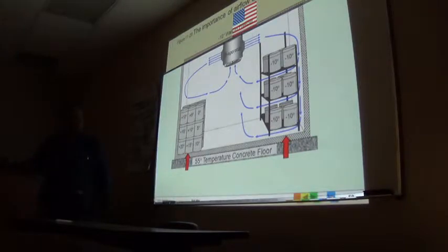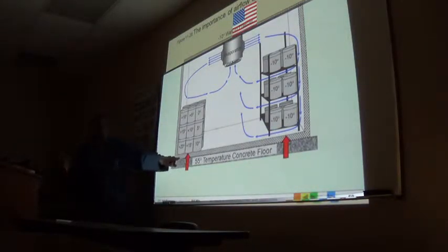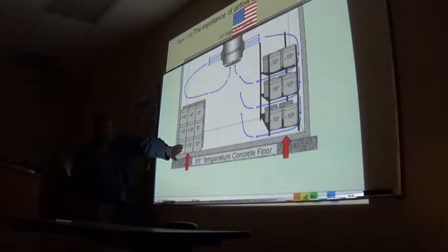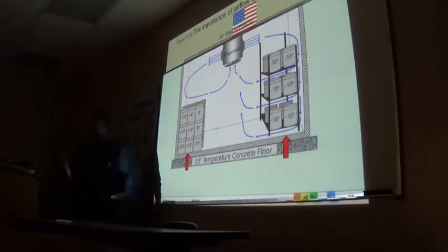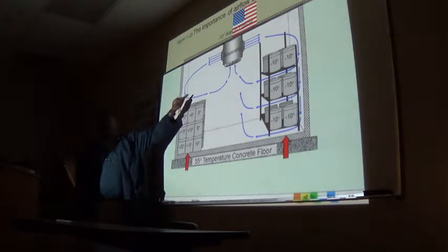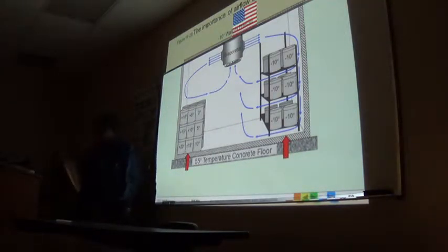These temperatures here, though, on the left side, the one on the bottom corner is 20 degrees. Yeah, because this is sitting on the floor. It's all the insulation. And it's touching the wall. There's something on top, there's something on the side, and there's something there. So this can't get any kind of air, period. So, by the way, this is a no-no in the food industry. Nothing should be on the floor. That's what I'm saying, the shelves are supposed to be used. Does that say positive 20? Yes. And this is at zero. This is a negative 10 freezer. But the ones on the shelves, they're all at negative 10. That's why the shelves are... Yeah, that's fine.